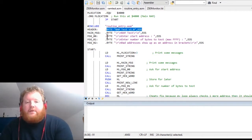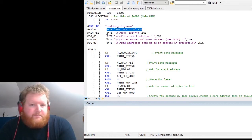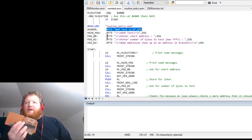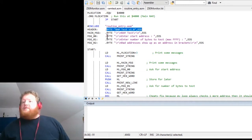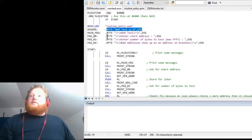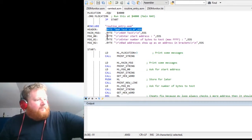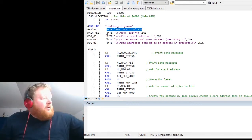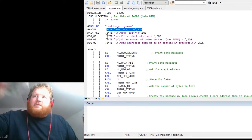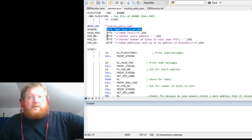That was a clever idea and I definitely want to have that in my system. I'll probably have an extra card made up with a bunch of ROM sockets so I can put in different ROMs — or maybe even look at cartridges. I've got a little header here; this is actually the 16-bit ISA extension, so we can have a card with some flash ROMs in it. I can just stick software on like that.